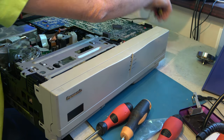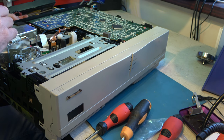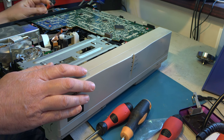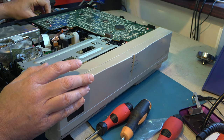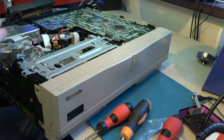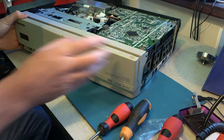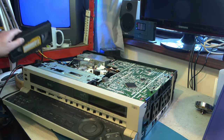Now, of course, you should, and I may, go over this with an oscilloscope and check the FM envelope. But it might be that it's clearly so perfect as to not need it. So that would involve finding the test points. I can't quite remember where they are on this machine. Find the test points and set an oscilloscope up to look at the output from the heads. But first, let's see if it plays. If it doesn't, we've got bigger problems.